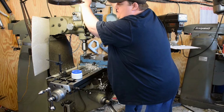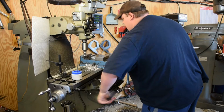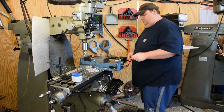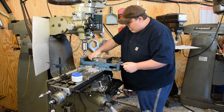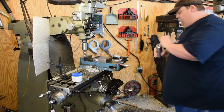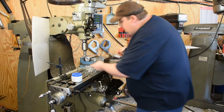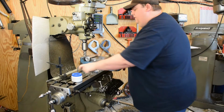First thing we got to do is slab off one of the sides flat to make us a nice spot to drill and tap. So we're going to take and put the world's sturdiest drinking straw in the vise here, just barely touching it. Push it back flush with the stationary jaw. Give it a little snug so it don't get away from me.